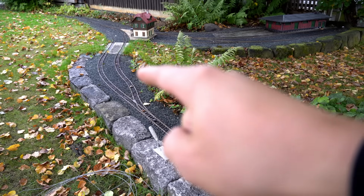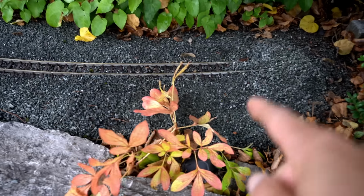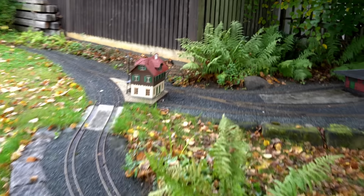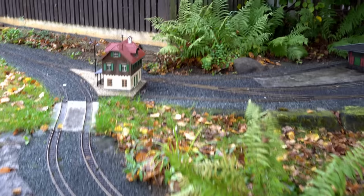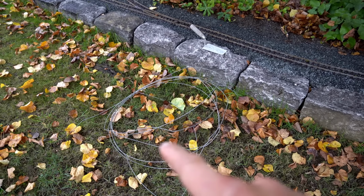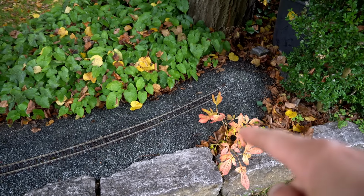We will start prepping the wiring on this side of the railroad crossing, and since I was planning ahead, I've got an underground conduit which comes out of the ground right here and it feeds the wiring to this corner of the building. So what we need to do is to feed in a pulling wire and then we can pull the wiring through the conduit.